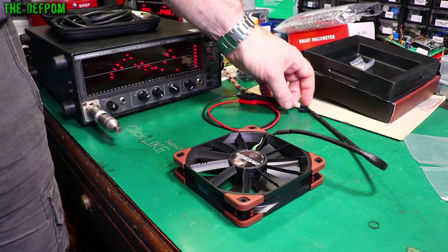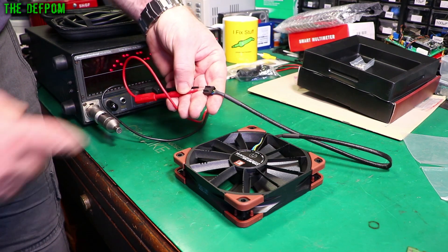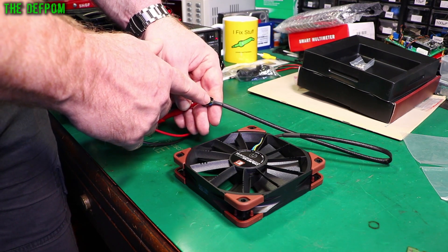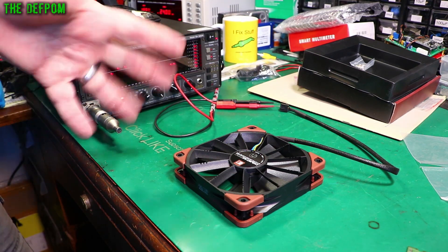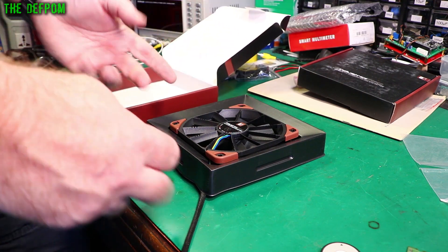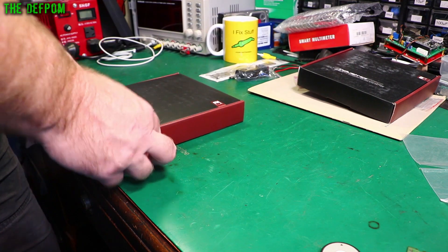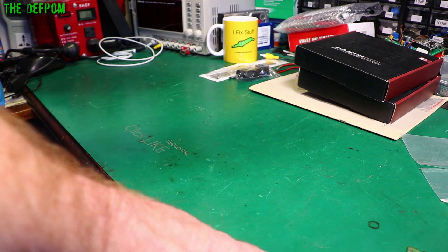The peak is about 250 Hz and 500 Hz is a harmonic on it. It's pretty quiet - for a 24 volt industrial fan it's pretty quiet. I just looked on Noctua's website and this connector has four wires - black is ground, yellow is 24 volts, green is an RPM pulse output, and blue is a 5 volt PWM input for speed control. These fans did come from China via AliExpress, and on the Noctua website they appear to be a discontinued product - that's probably why they're on AliExpress, clearing out old stock. These were about $40 to $50.